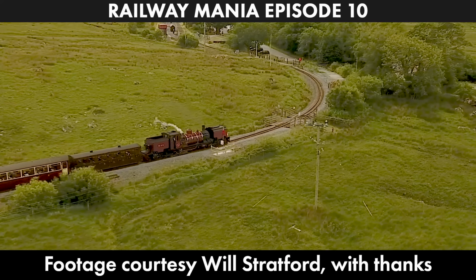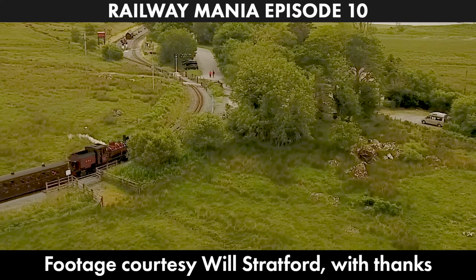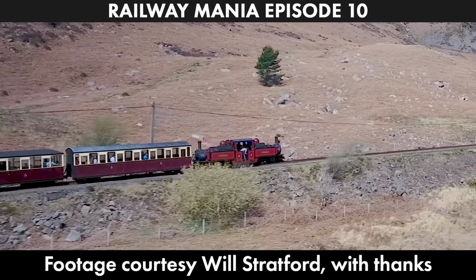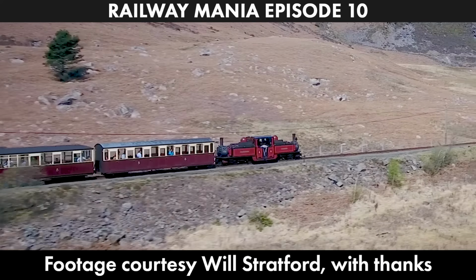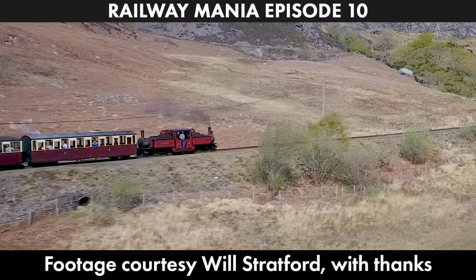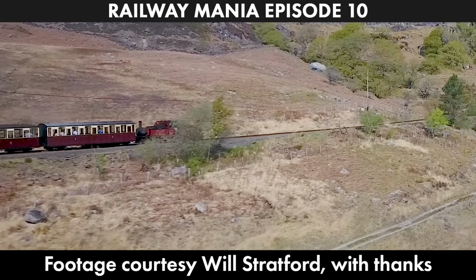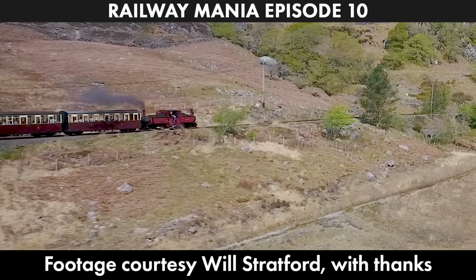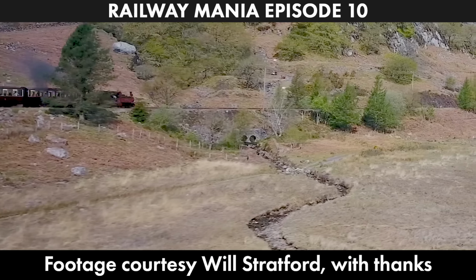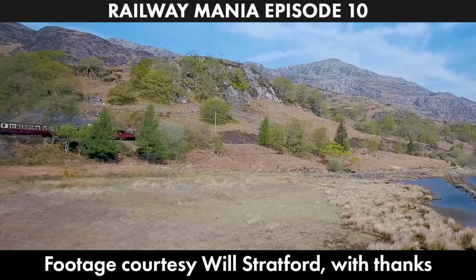Mainly, it's very restrictive compared to an NG16, obviously because your cab is only, I think, about 18 inches wide and about 5 foot long, compared to a 16 where you've got a full conventional cab. And what some people struggle to get to grips with at first is that you have the twin fireboxes. The technique for getting the coal into the corners right underneath the fire hole door can be quite difficult to master. Are you in effect firing it from the side? Yes. On a conventional engine, on a Garratt, your grate will be sloping away from you, so the door's at the back and the grate slopes away. But on a Fairlie, the grate slopes to the side, front of the engine or rear of the engine, but it'll be to the side of you. So that can be quite a challenge to master.